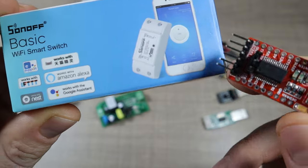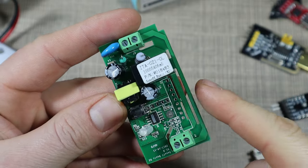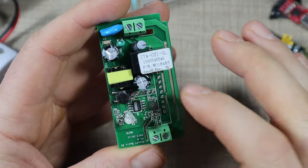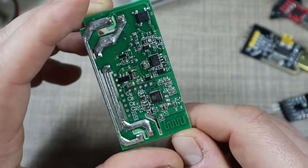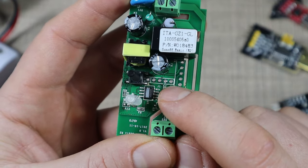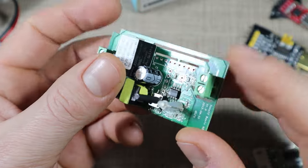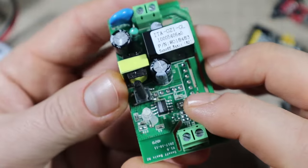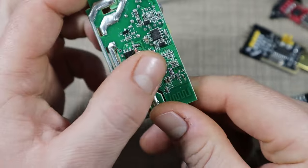This one is the Sonoff Basic — mine is revision two — but the same principle applies to all the different versions Sonoff puts out. In its simplest form, the switch is basically a microcontroller with a relay that has all the power and control circuitry built in, and they are quite inexpensive so they really serve a great purpose. For controlling them with Home Assistant we need to flash custom firmware, and for that the people at Sonoff left us with a serial breakout on the board. This one doesn't have a USB — it comes pre-programmed with the proprietary Sonoff firmware — so in order to flash custom firmware we'll need to connect a USB-to-serial adapter and interact with the chip directly to reprogram it.